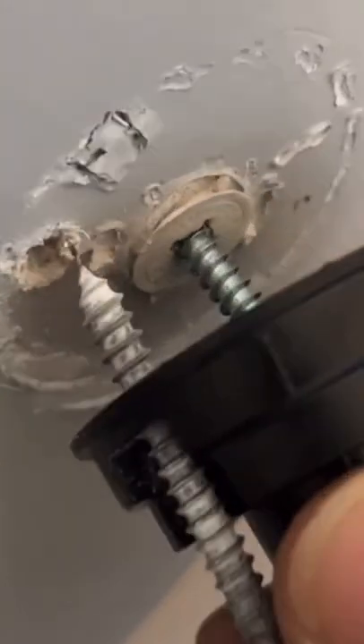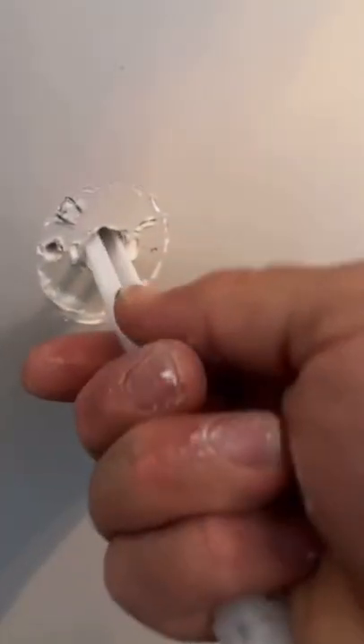So the first thing you've got to do is remove the toilet paper holder to expose the bracket that holds it. And as you can see, everything was really loose — they only put one anchor in the middle. So what I'm going to do here is use a toggle anchor on the same hole. This way I don't have to drill new holes on the wall and I don't have to patch these ones.